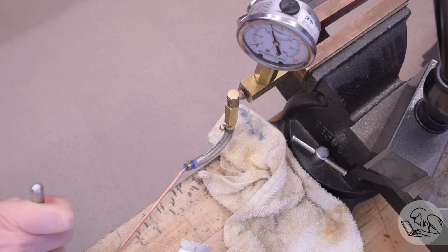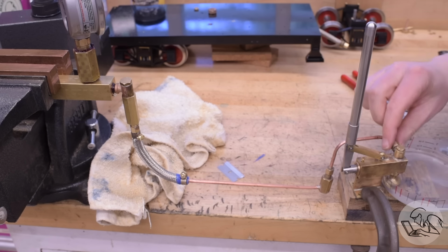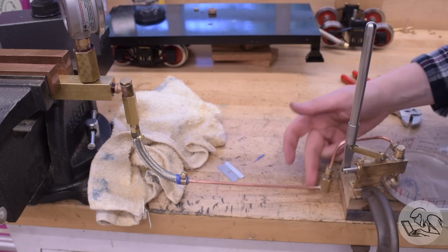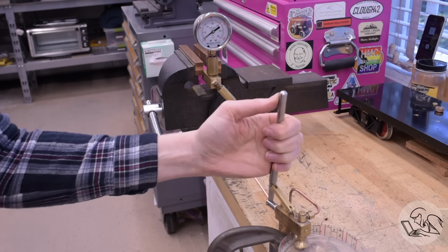So that's Kozo's design for a taper seal. It's a 45-degree taper up against a sharp metal edge, and it's not quite enough to seal at 125 PSI, at least not the way I made it. There might be some manufacturing flaws in there. The good news is all the other fittings are bone dry, so those all seem to be working great as designed.